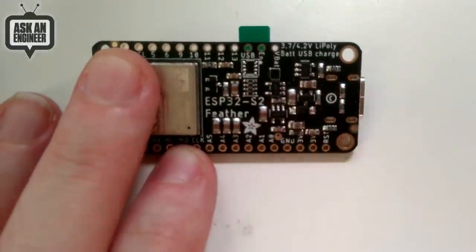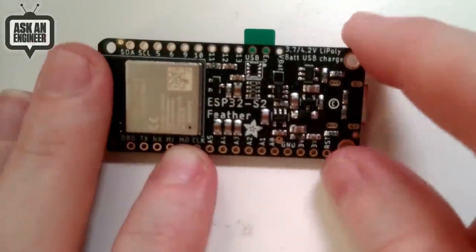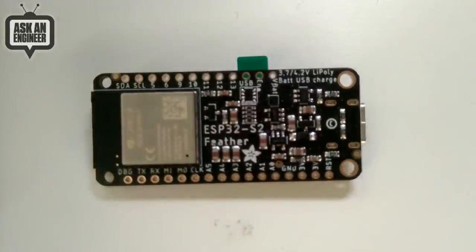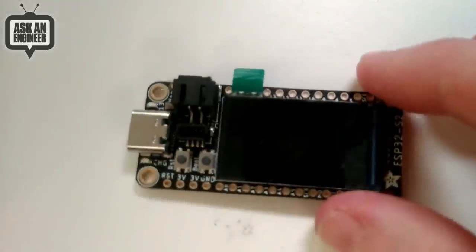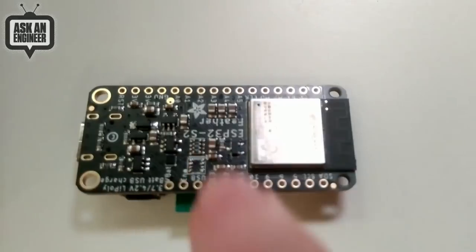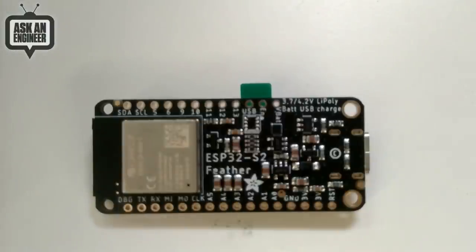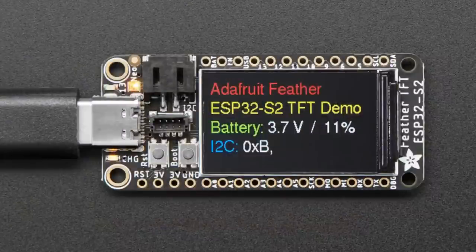And there's also a second regulator. The second regulator is used to disable power from the I2C or TFT display. So you can do ultra low power usage, because more people are trying to use our boards for low power. I had to redesign it due to the component shortage. So you can turn off the TFT power and the power to the I2C port and get down to 80 to 100 microamperes, which is about as low as you can get in deep sleep when using an ESP32-S2, and still have the regulator. And then in a lighter sleep, where you want to resume execution, I think it's about 1 milliamp. So overall pretty full featured board.